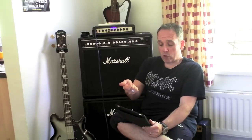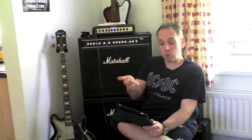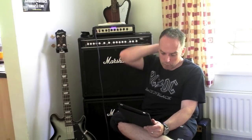Okay, the bass, as I said, all the EQ controls, when they're in the 12 o'clock noon position, they're flat: no cut, no boost, signal unchanged. So the bass dial, first of all, is giving you a 12 dB boost or a 12 dB cut at 40 hertz. So the same frequency that the ultra low switch is targeting, but you can vary that from minus 12 to plus 12 dB at 40 hertz. And flat in the middle upright position.